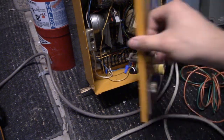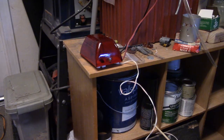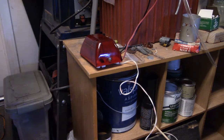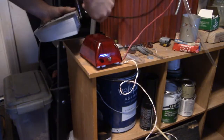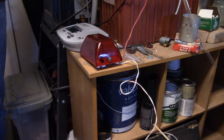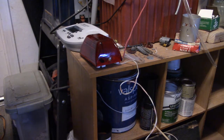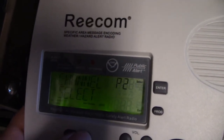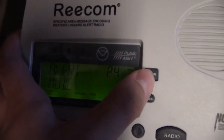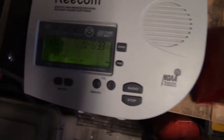Now you've got your wires connected. Close the AR timer and turn on power to the siren. Now disarm your siren or disconnect it. Bring your weather radio back over and simply connect it to the alarm out on the radio. You should hear the relay click when you connect it — that's why you want to disconnect your siren before connecting the radio. Go into the program menu and make sure your alert mode is set to voice — you want to make sure it's set to voice.